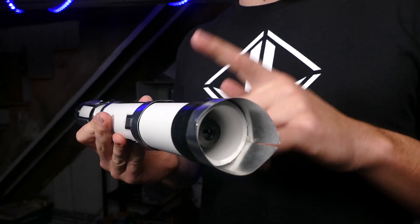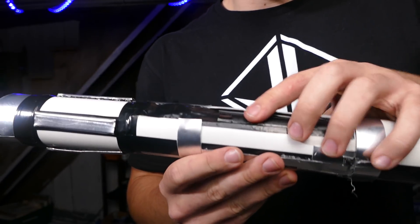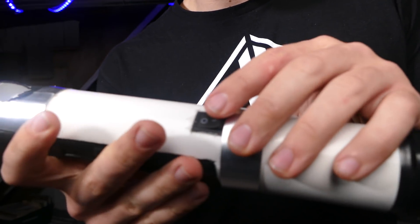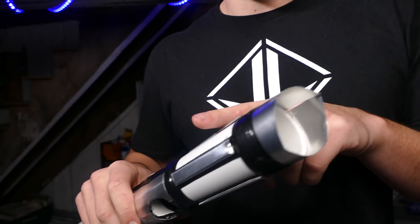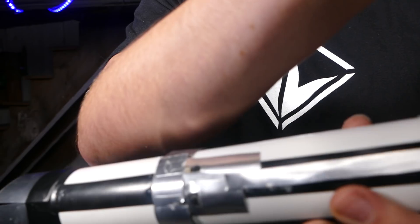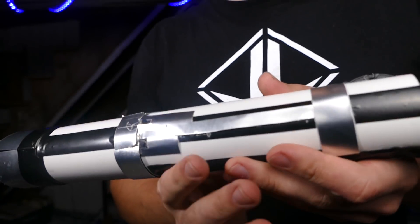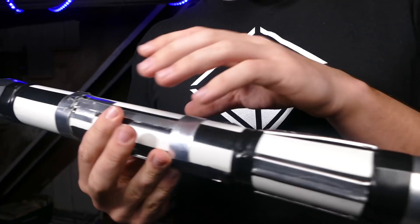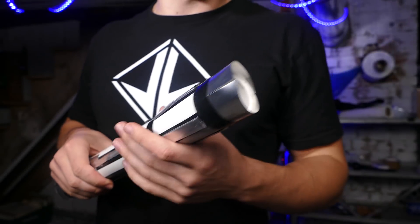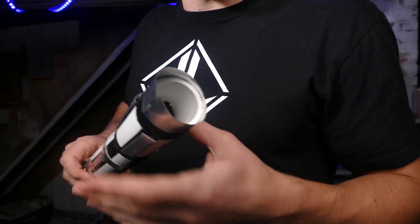So hopefully that helped you guys understand how this thing is wired a little bit better. We've got the main switch right here — this turns on both the lasers and the fan. And then when I want smoke, I just press this vape button and the coils heat up and push the smoke. Both lasers on plus fan is controlled by this switch right here. Now if I just want one laser on — just this one — I have another switch down here. First, I flip this slide switch right here to pretty much just disconnect this laser from the main circuit. And then I use this tiny little push button right here to activate this laser through another circuit, also wired up to the batteries. This circuit that the push button controls only activates this one laser.